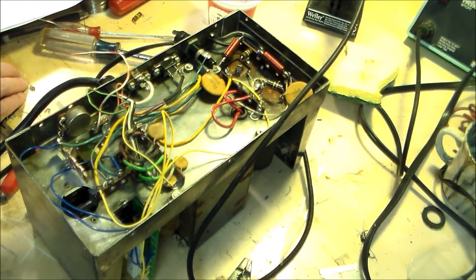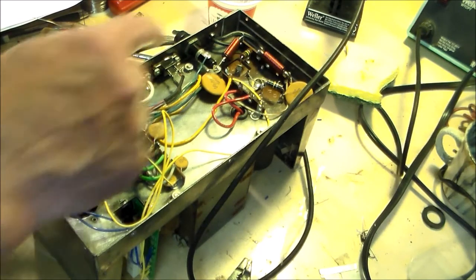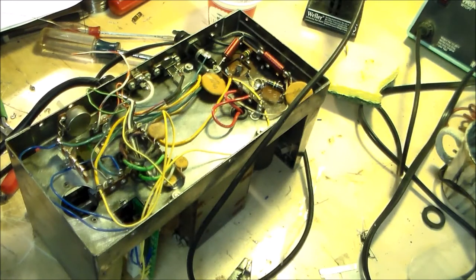And now you should have both large blue wires attached to their counterparts going to the PCB. Large blue, yellow should be okay. Now run a red wire from either red wire that is soldered to the terminal strip that contains the two large red wires and single yellow wire, run that wire to the pad on the PCB labeled red. So I need